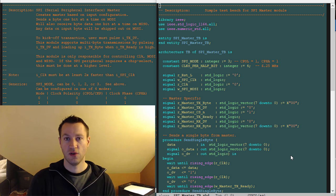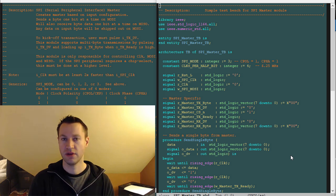One, building and synthesizing takes a long time. Even if your project takes 60 seconds to compile and program, that's 60 seconds every single time you make any change, which adds up pretty quickly. The second thing is that actually getting any understanding of what's going on usually requires a logic analyzer, oscilloscope, or some sort of debug tool. You don't want to rely on those things because it's tedious to set up, and you have to decide what you're going to monitor in advance. So I spend as little time as possible debugging on hardware as a general rule.